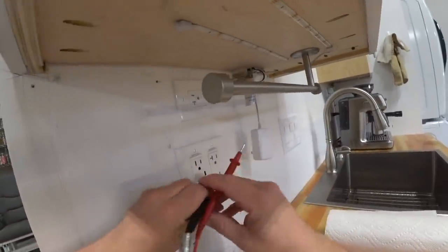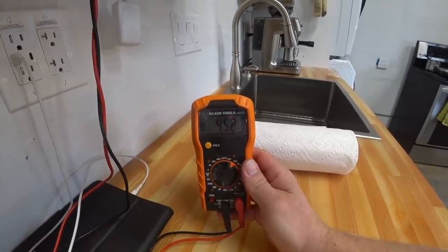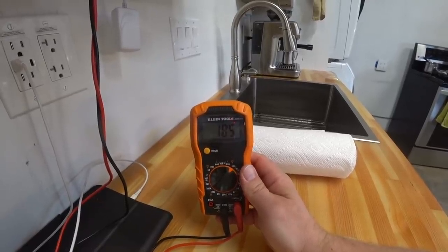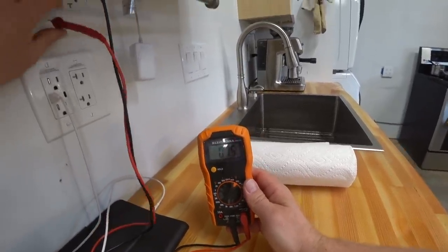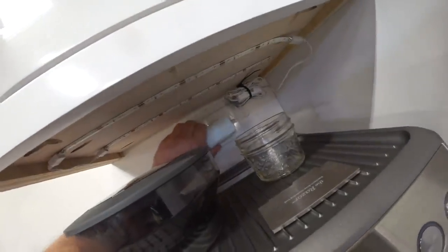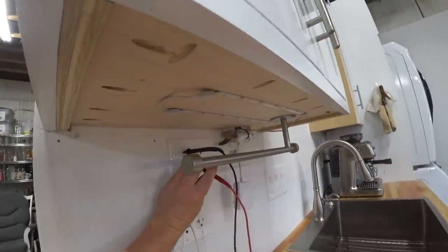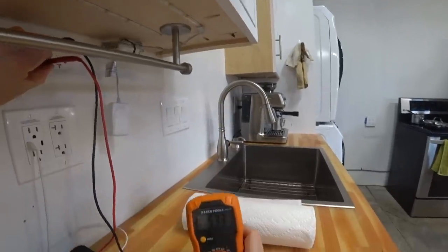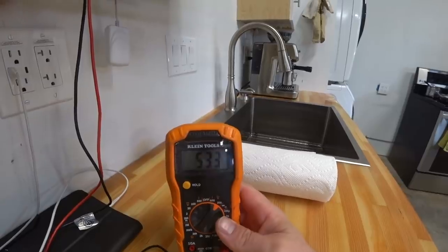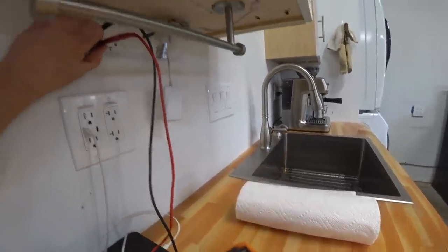So let's check for voltage here and see what we get. So what you're going to see is the voltage going up, up, up, strobe, down, down, down, then up, up, up, strobe, down, down, down. All right, if we unplug the other light, let's take a look at what happens when we do that. Okay, and this is where we're gonna see what's happening in the underlying problem. So what we should see is about 55 volts. We're showing 53. And it should be fairly steady, which it is